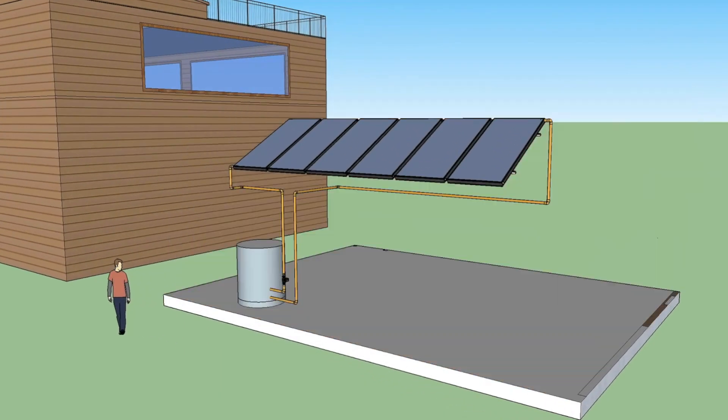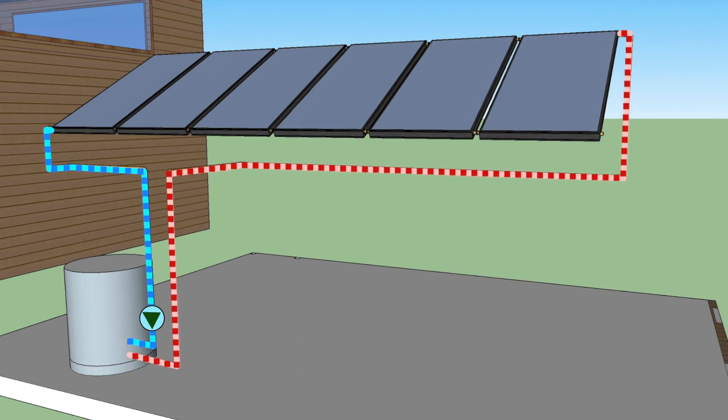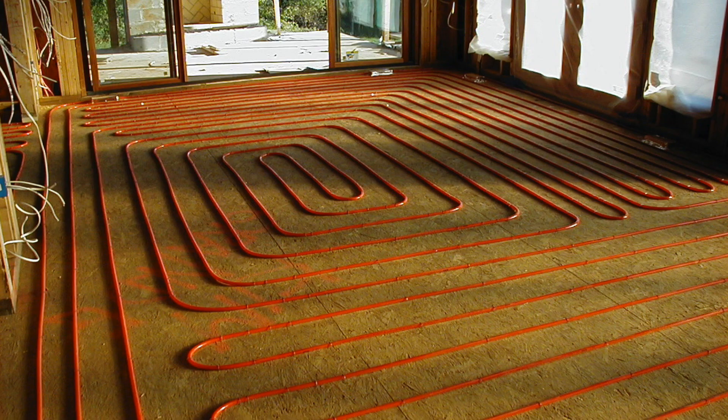To provide you with a basic understanding, all solar thermal collectors we'll be discussing today operate by circulating a thermal fluid, typically water or an antifreeze solution through them. The fluid collects heat from the collector and transfers it to a storage vessel of some kind, which could be a pool, a residential hot water tank, or even a large-scale commercial storage vessel. In some cases, solar thermal fluids can even be pumped through a radiant floor heating system.